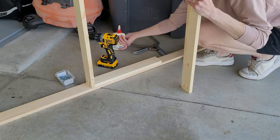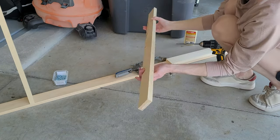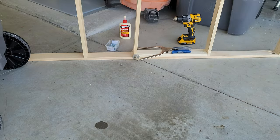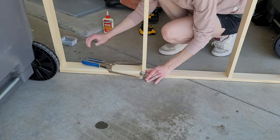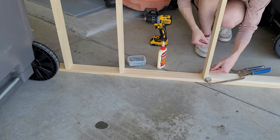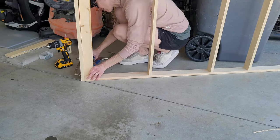I like using a board on both sides to make sure the shelves are level. When attaching the shelf, make sure it's flush on both sides — that seems like a no-brainer, but I've clamped in a hurry before and it was off, which was very frustrating. Once you have one side done, flip it around. I used some trash cans to hold it up while I used that same spacing board to guide the distance. My middle shelf is about a foot, smaller than the 18-inch shelves, because of the switches along the wall.